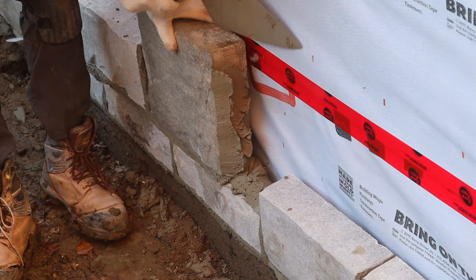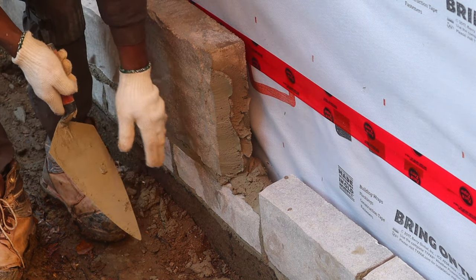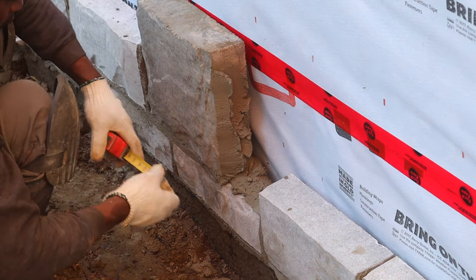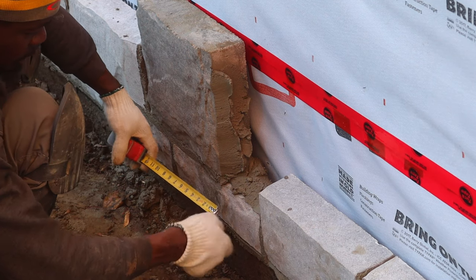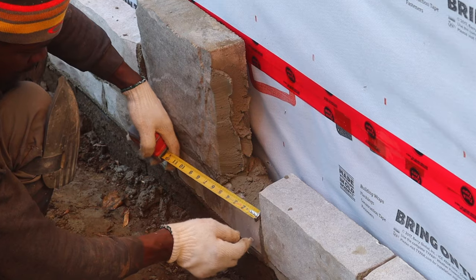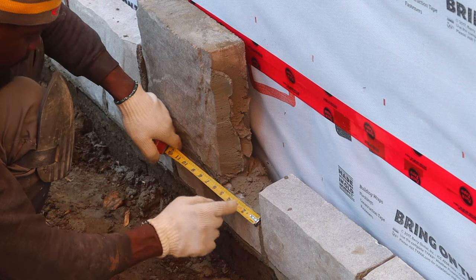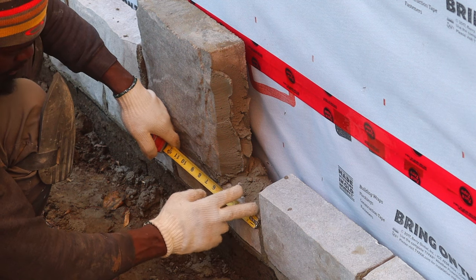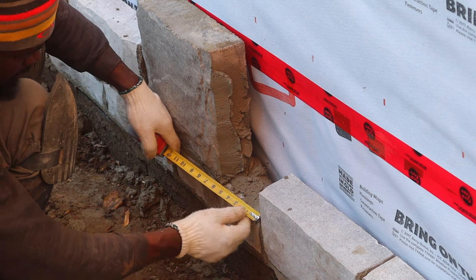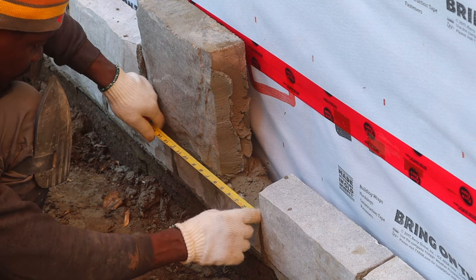So here we have a big, we have a small here. Jumbo is the same name as the big. That's what we call it. So we're gonna measure the piece to go here. The way we wanna measure that, we wanna hold our tape right under the end here of this one and measure. The reason for that is we wanna have the joint match up with this one here. So it's very important to put your tape always on the end that's already there.